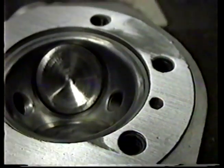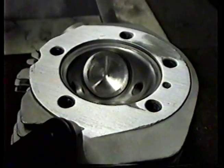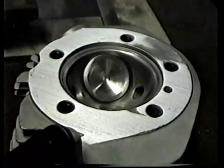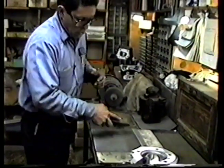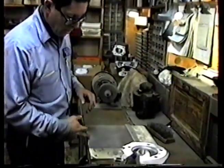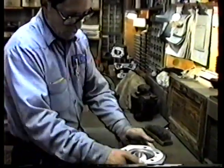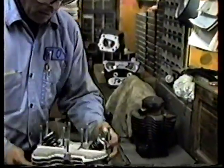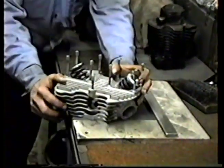We take them down till they're just barely clean — we don't take any more metal off than we absolutely have to. Also, after every few strokes we have to clean our emery cloth off so it doesn't load up. If it loads up it'll put a crease across it, which we try to avoid because we can't send them out with any kind of creases on them.